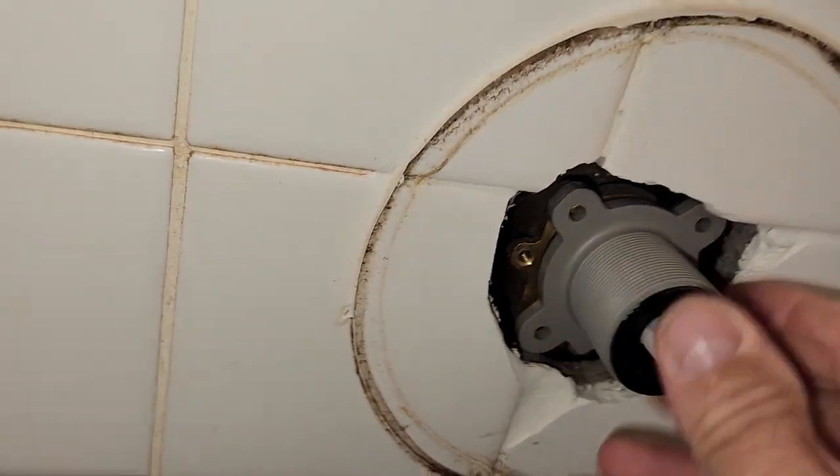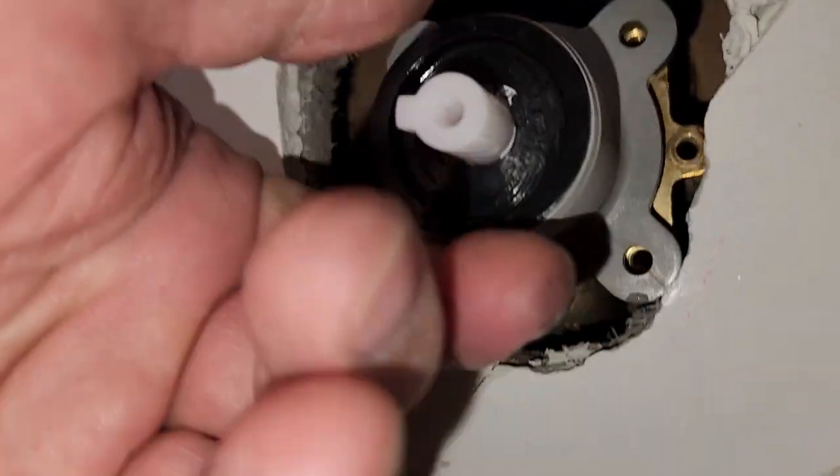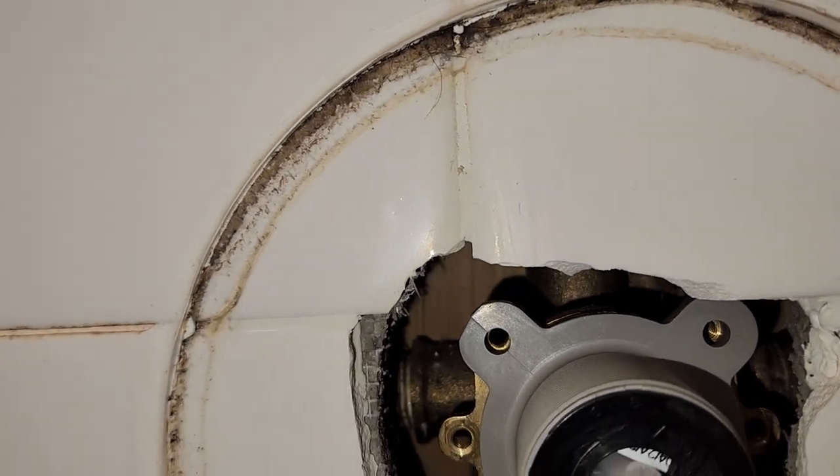There's also an O-ring on the backside that seats into the brass valve body — you want to make sure you get that in there. Then we're going to grab a stainless steel collar ring that fits over the plastic, with four stainless steel screws, and put that on.